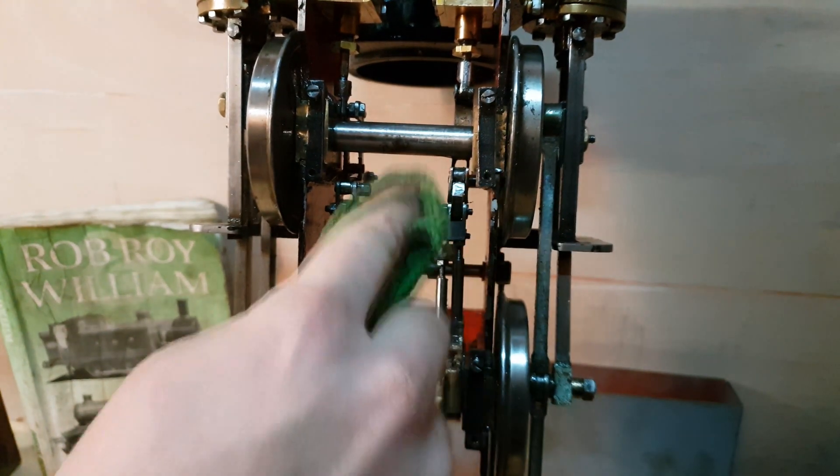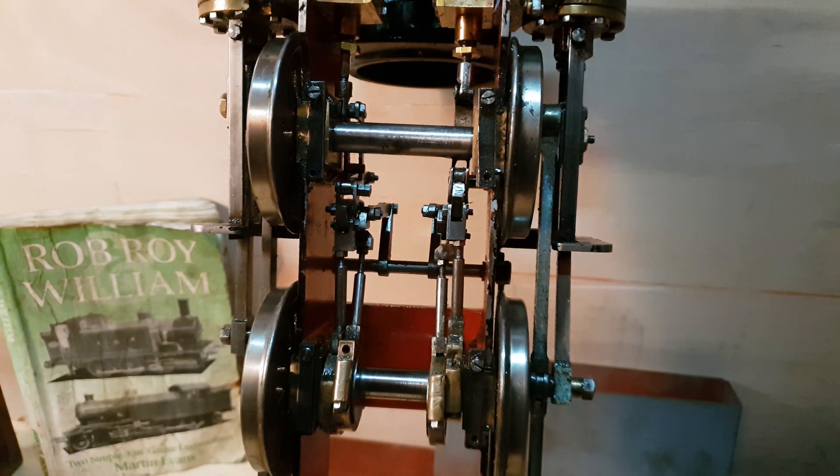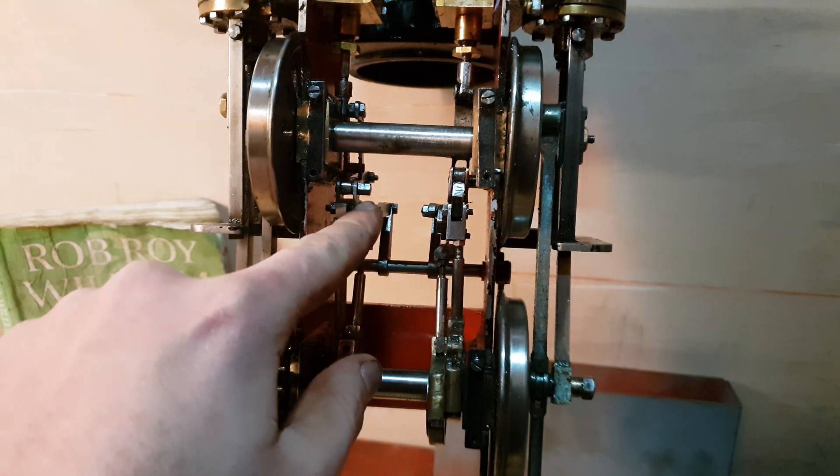After a bit of a cleanup I'm going to take out all of the bolts. These are just BA bolts and the threaded surface on them is no good for a bearing surface — they need to be machined shafts.